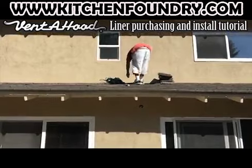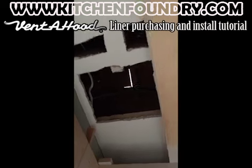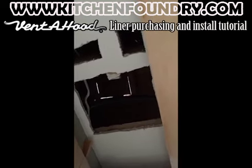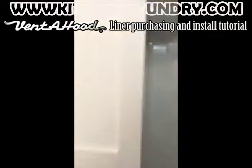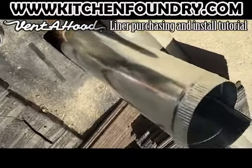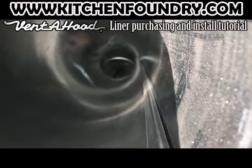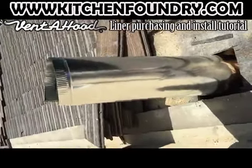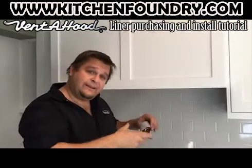Here we have our roofer who's cutting a penetration for me in the top of the roof so I can actually get my duct in place before the hood goes up into the hole. Now I've dry fit my ducting into this space between the top of the hood and the roof line. This is a shot from the roof line looking down at the duct pipe going into the kitchen. Basically I'm just going to trim this down to the appropriate size for the roof cap that I'm using. In a lot of cases, you just cut it to the right size ahead of time. It all depends on the type of roof cap that you're using.